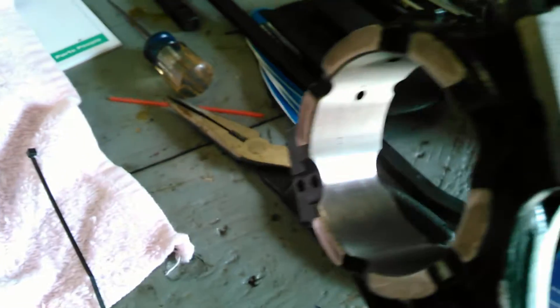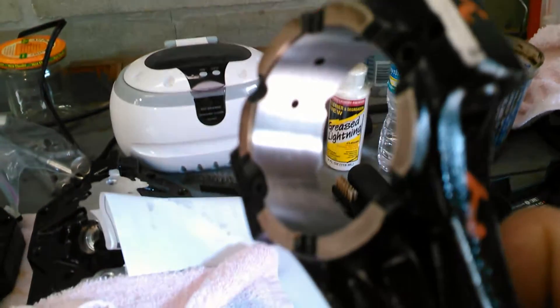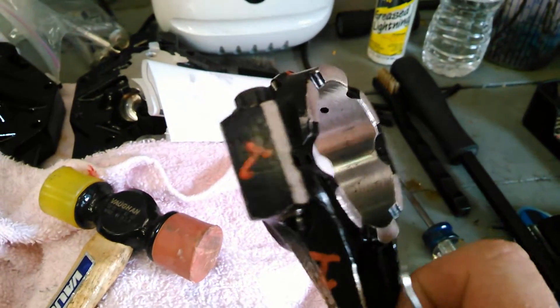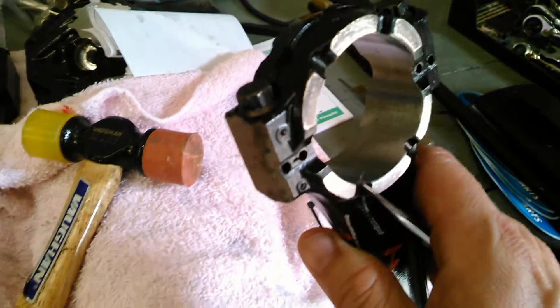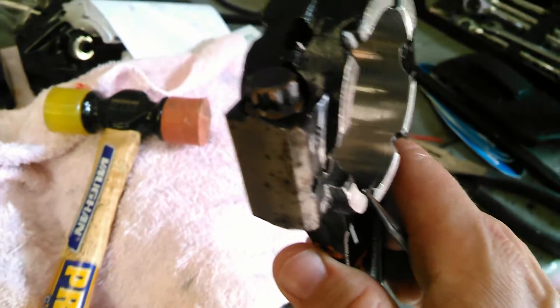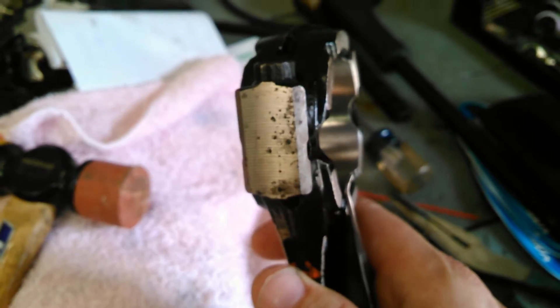See that one is kind of crooked. You can see the seam — on the right hand side there, the seam is actually not straight. But the idea is the rods actually go back together perfectly. Then they mill these ends — three sides — and they sell a special tool, it's $500, to line these things up. Because the bolt holes are bigger than the bolt, so the bolt doesn't line anything up. You've got to line these things up, and that seam should just pretty much disappear.